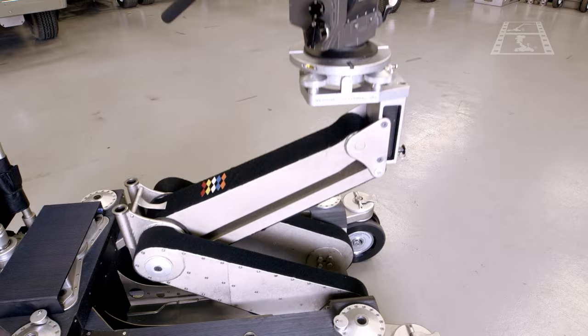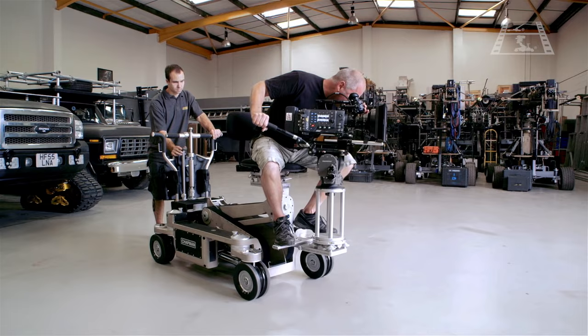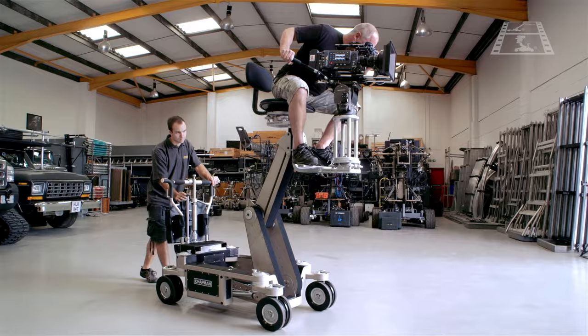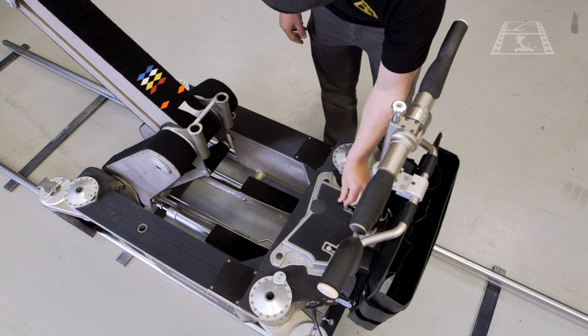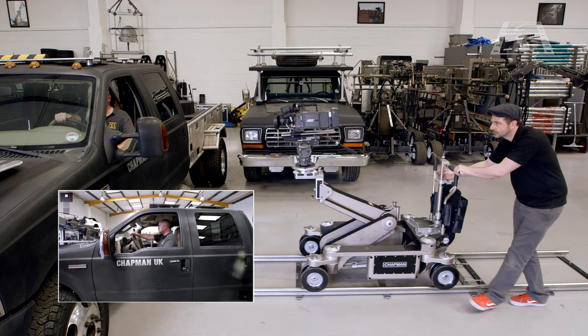The Hybrid 4 features a built-in automatic oil heater to ensure smooth operation even at very cold temperatures. The ride-on performance of the Hybrid 4 is also enhanced by the inclusion of a dedicated nose seat for operator comfort and safety. A familiar feature that hasn't needed updating on the Hybrid 4 is the use of coloured Velcro markers for plotting start and stop positions when using the arm. A set of control levers located at the rear of the dolly under the removable footplate allow you to preset the arm's position and adjust the sensitivity of the start and stop speed of the arm. Known as feathering, this feature is most useful for ensuring consistent preset movement of the arm over multiple takes.